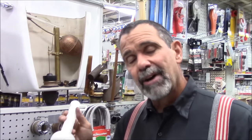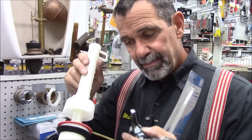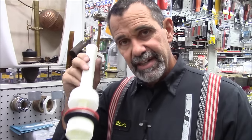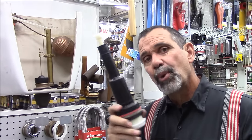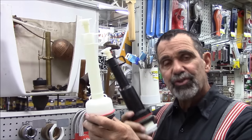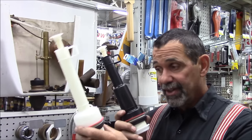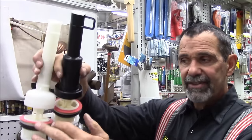Two kinds of gaskets happened about 20 years ago. They went from the gasket being on the moving part to putting the gasket on the base. For those of you working on a newer Mansfield Toilet, the new Mansfield towers are black and they are for a 1.6 gallon flush toilet. These older style here are for the three gallon per flush toilets. Either one, they both work the same and they both have the same gasket.